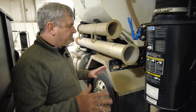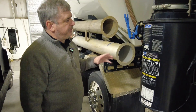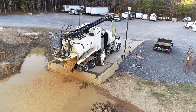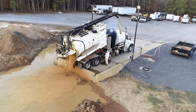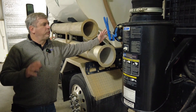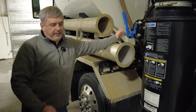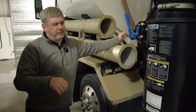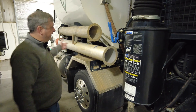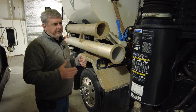The vacuum pump is a vane pump. This truck has a PTO, but all the PTO does is run the big hydraulic system — because the boom lifts up, it dumps like a dump truck, and it handles all those hydraulic functions. This industrial air mover's vane pump requires so much horsepower that you push the clutch in, flip a switch on the dash, and put the truck — it's a 10-speed or 13-speed — into the equivalent of eighth gear. The driveline off the engine then drives this pump, because it takes nearly 300 horsepower to run the pump at 5,000 cubic feet per minute.